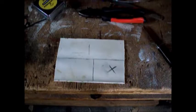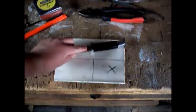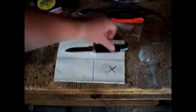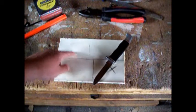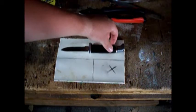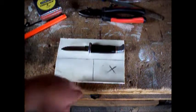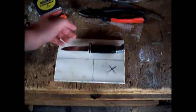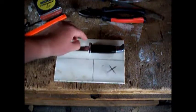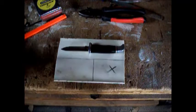I've got my flat PVC and I've drawn some rough lines out for how I want this to fit around the knife. The knife is going to sit right in the sheath with the bolster up against this line, and the back of the blade is going to be right up against this other line, so it's semi-centered in the sheath. We're going to fold along this line here. We don't need the entire thing — we just need to cut this section out, and then taco it over and fold that. Then we'll mold it so it fits around the bolster for retention, and clean it up with the Dremel tool later.